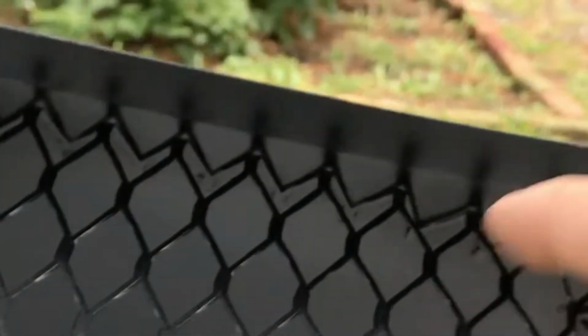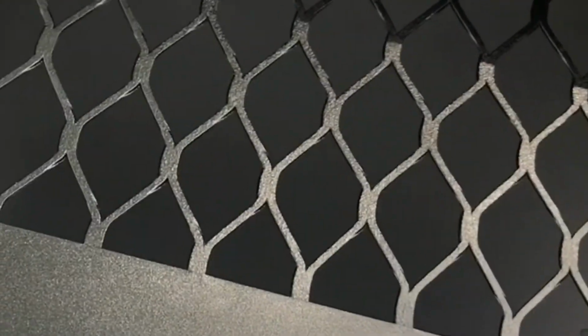And then you'll typically have, from the top of the base to the bottom of the lid, 10 inches, not always 10, could be 8 inches, I'm guessing this is right at about 8 inches, of animal guard, the screen here, animal guard spark arrestor. Extremely important. Now if you notice here, this is 7/8 inch gaps. That's fine. It will never keep insects out, but it'll keep things like birds, bigger critters out.